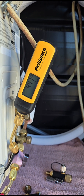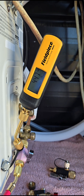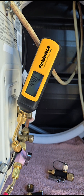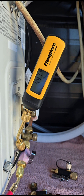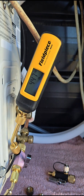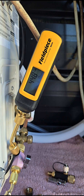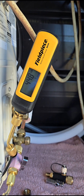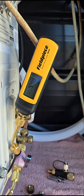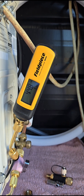I did a 20-minute decay test and it held. So we're under 500 microns and we are allowed to release the refrigerant to the system. All the line set has been cleaned out — the non-condensibles have been boiled out — and it held. So that worked out great. 20 minutes have gone by and it's perfect. It's a little pump and it worked. So that's your answer: you can use it, but go longer — go an hour — and then do a 20-minute decay test. That'll be rock solid.